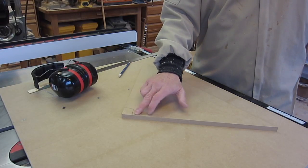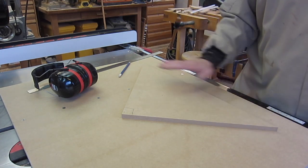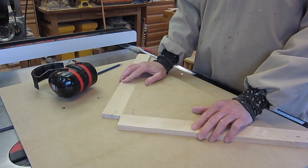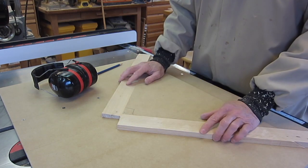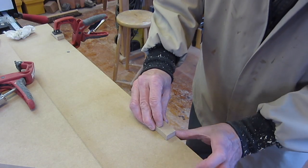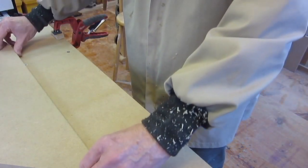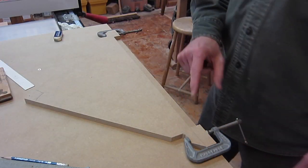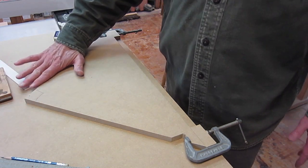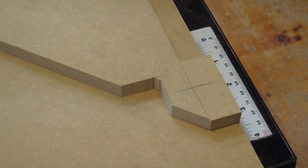There's my 90-degree corner from the crosscut saw, and then I took the remainder of the piece off. These are about 45 degrees but they don't have to be accurate. I've solved half my problem because I can rest the fences against this triangle and know that they're at 90 degrees. I've still got the problem of how to orient this perfectly. These blocks are for the triangle to rest against when doing the calibration — their exact position is not important. I cut notches in the triangle so I can clamp it to the reference blocks, then do precision repeatable cuts and determine how much I need to shim and on which end. I put a pencil line here so I can always get the same alignment.